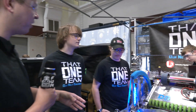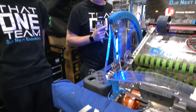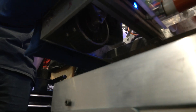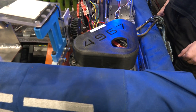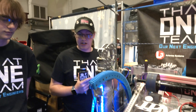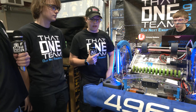Tegan, do you want to dive a little bit more into the Swerve modules on your team, as well as some of the 3D printing that you guys use in addition to your rising suns? The Swerve modules we used are MK4i Swerve modules. We run Neos to run the module. We don't have any customization to it other than our covers, which are covering the Spark Maxes and other electrical stuff like the CAN. These Swerve modules were integrated into the frame in a way that we can replace a single Swerve module quickly — there are four bolts holding them in, and we pull those out and can pick it up out of the frame.